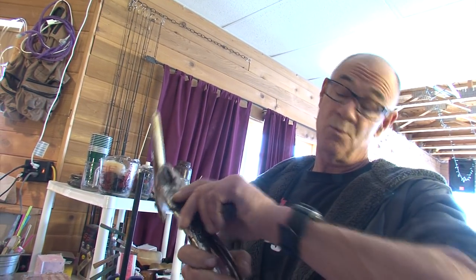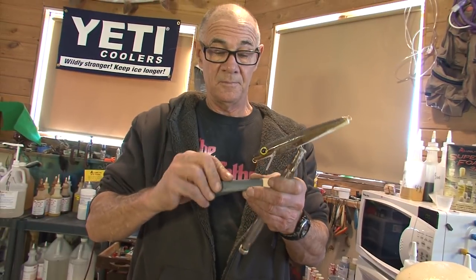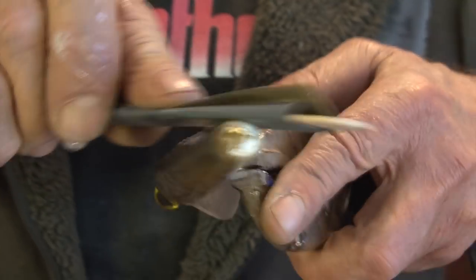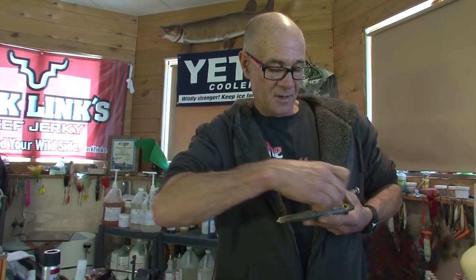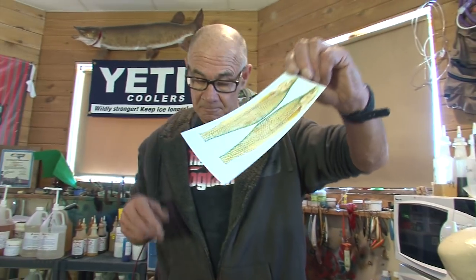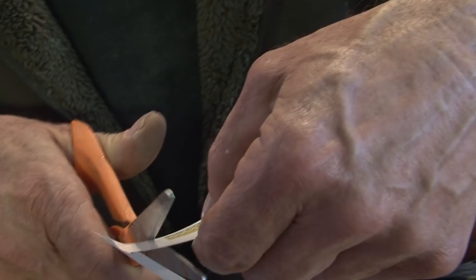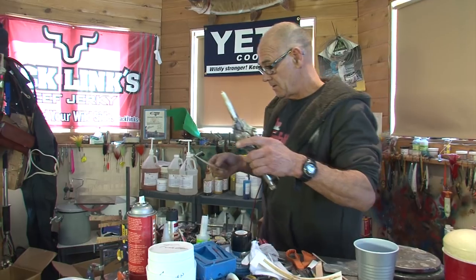This feels pretty good — it's only been 20 minutes and this is ready to go. I'm just going to lightly sand it, and then we'll put the final finish on it. This is like 400-grit wet or dry sandpaper. I'm just going to smooth out this edge. Every now and then with epoxy, you can have a little bit of a foreign agent or release agent, or just some leftover chemical on the surface, and the epoxy won't marry to it the first go around. A little bit of sanding and another coat usually solves that problem. Here are the decals we made earlier — I've sprayed a relatively thin layer of clear acrylic on these. The thinner the layer, the more delicate the decal, but it's actually easier to stretch it on the lure.